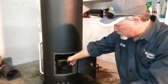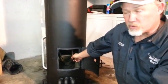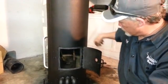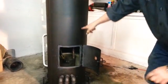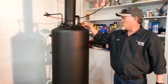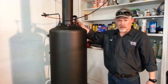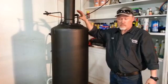This pipe over here is actually our air feed. We have a little blower — the same kind of blower that you would get, just a Coleman blower that you would put on an air mattress — with a three-quarter-inch copper pipe. That goes straight up on the inside and comes in right here. What we did is we took just regular rope sealant, like you'd get for a regular wood stove, clamped it down with just a regular pipe clamp, and tightened that up. This still moves slightly, but it's okay.